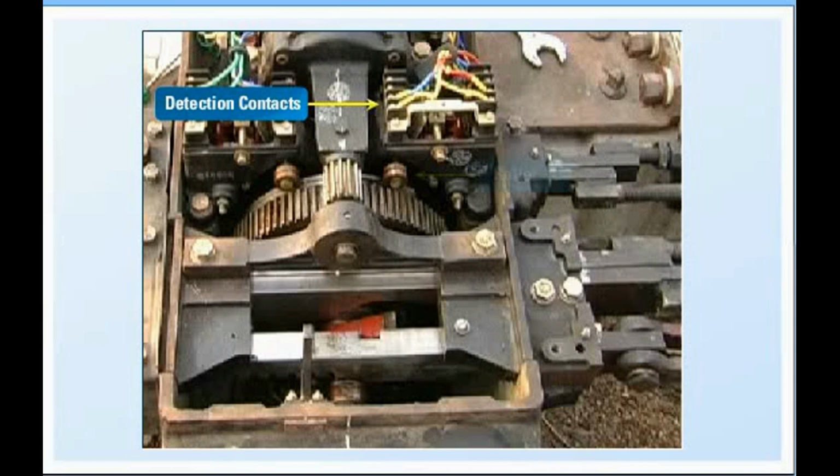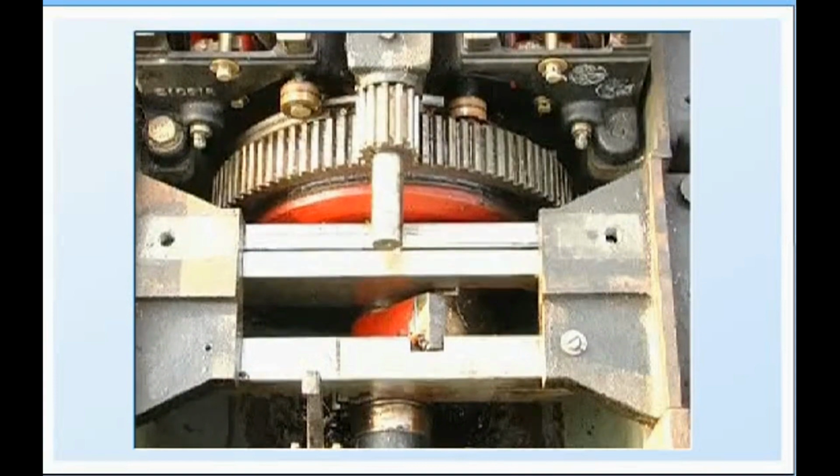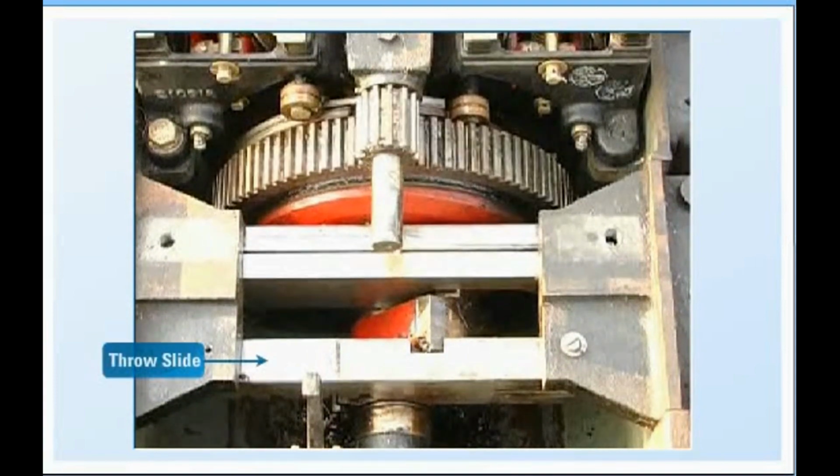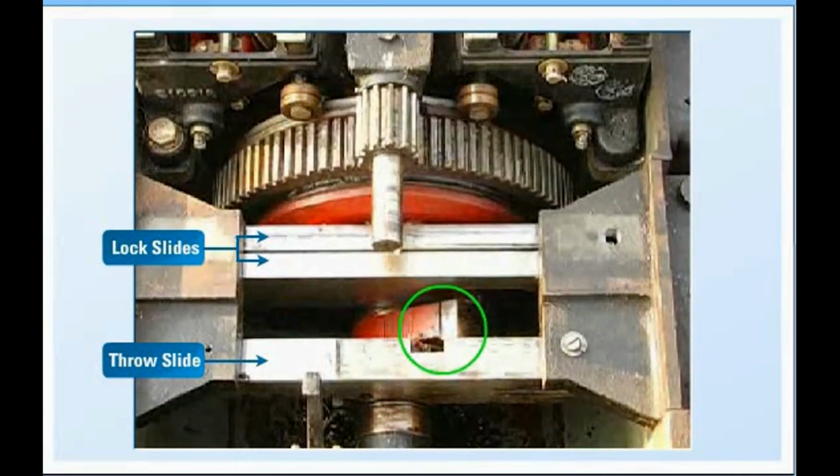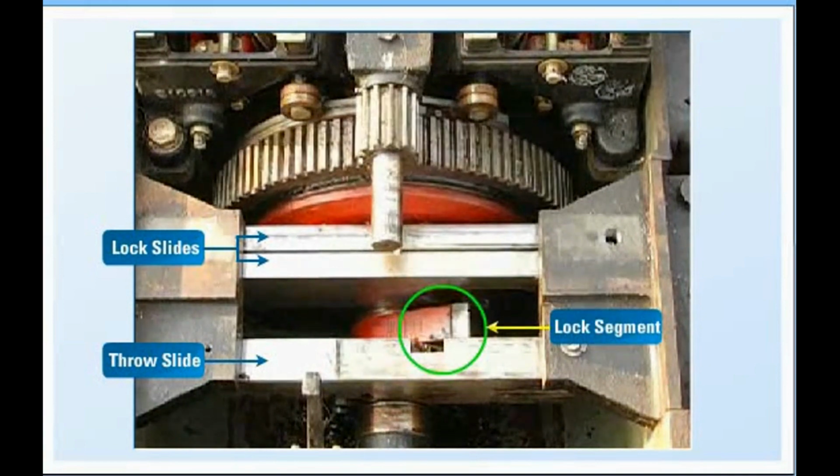Main gear rim along with friction clutch gets its movement, which causes friction clutch spring locking plate to engage with lift out disc. The movement of the lift out disc lifts the roller A even though control disc notch does not move as yet. This causes the opening of detection contacts.